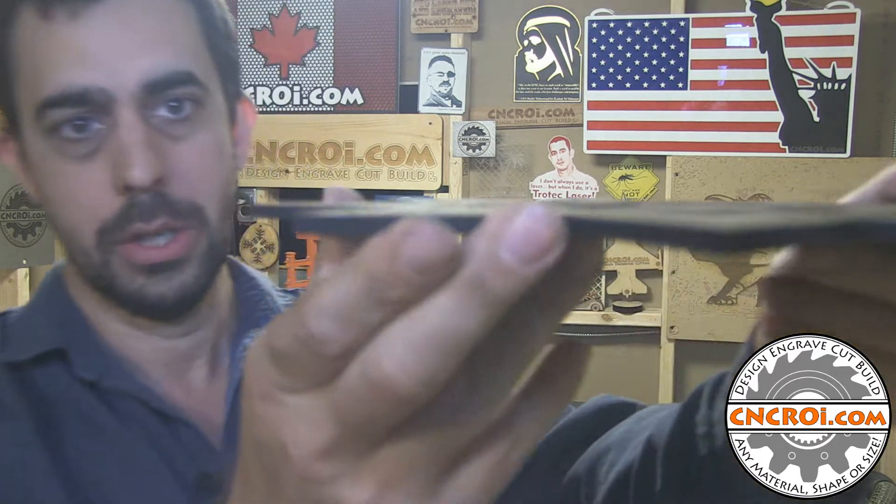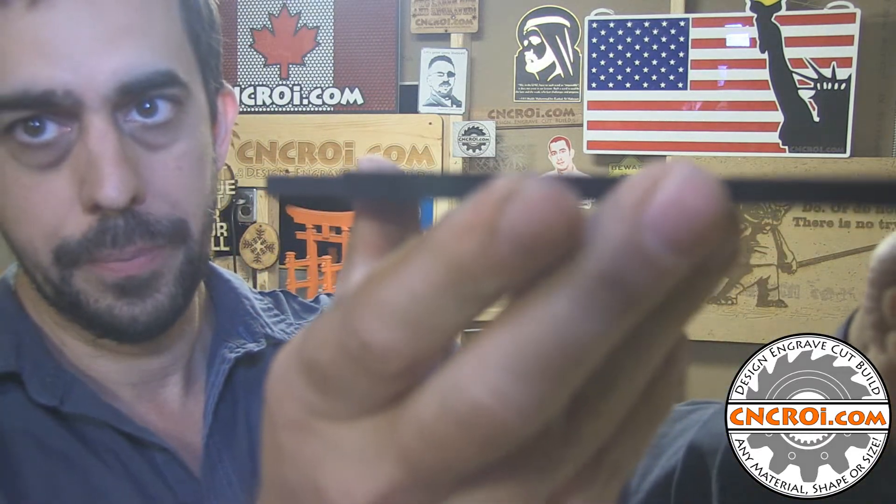The problem we start to have with the laser is that the further it is from the lens, the more out of focus it becomes. So in this case here, the profile is pretty much dead straight, but if this was, let's say, 1 inch thick, you'd actually see a profile going like this through it, just because it goes out of focus and it loses some power as it's going down into the material.